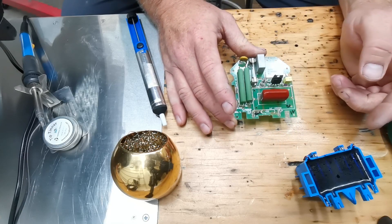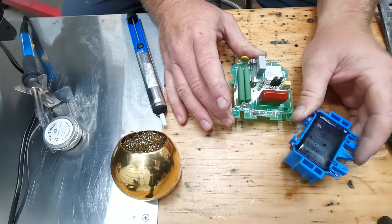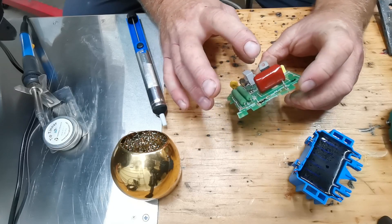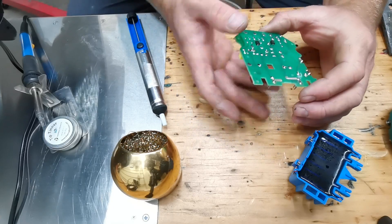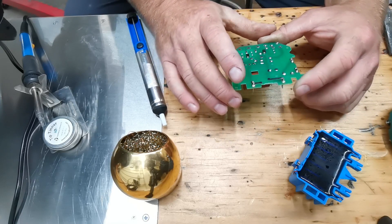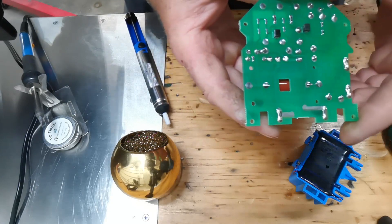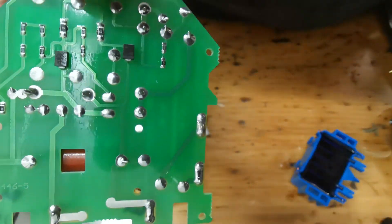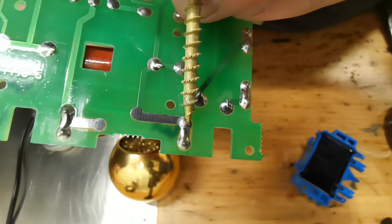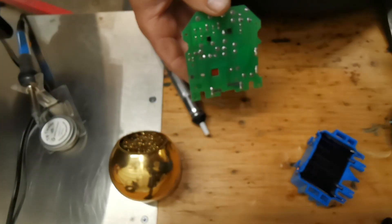The problem was this was intermittent and I didn't know if it's the transformer. This is a secondary transformer that transforms the high voltage — it goes from 110 to 220, I believe, or 250. This is the capacitor. What I did find on the transformer is that solder joint is cracked. I'll see if I can get it up close — you can see it's cracked right there, and there's also some haloing around that pin.